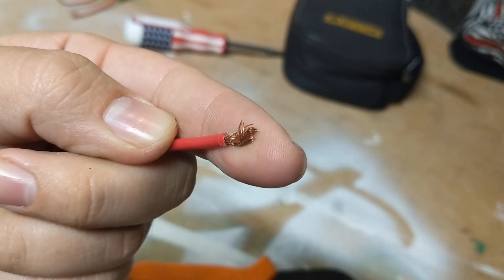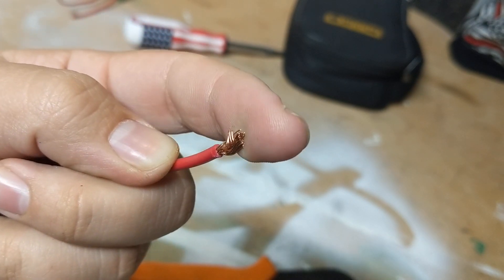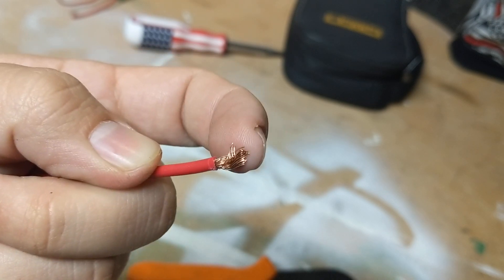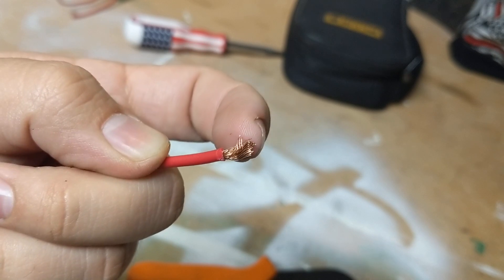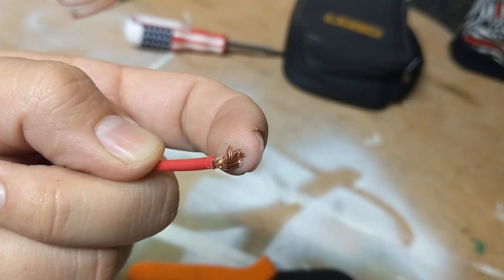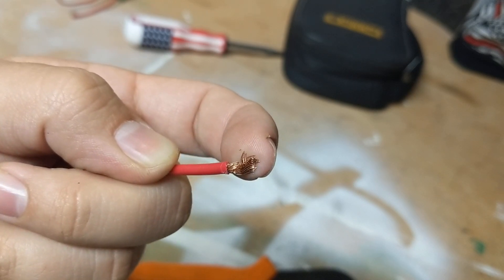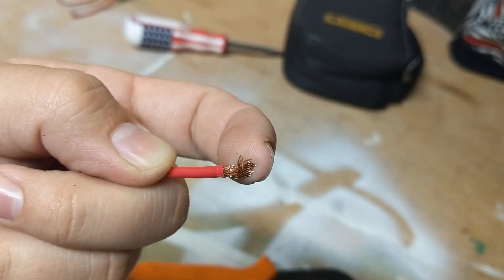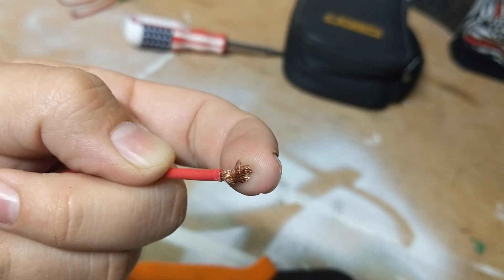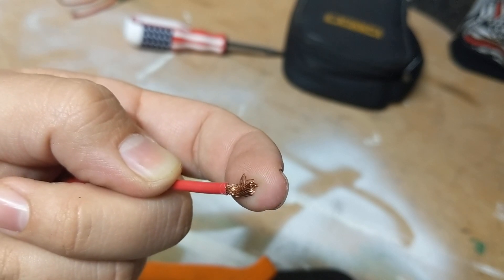The other problem, especially with presses, is that I've seen a lot of times the wires will come out. I haven't had to deal with presses too much in my life, thankfully, but a few times I had to go down to Alabama and that was our main problem. As the press comes down — boom boom boom — wires get jolted, and if they're not tight, or somebody cranks down too much and breaks strands, the connection's not good. Then you lose downtime and it's a pain, and it's always at the bottom underneath in the hydraulic fluid.